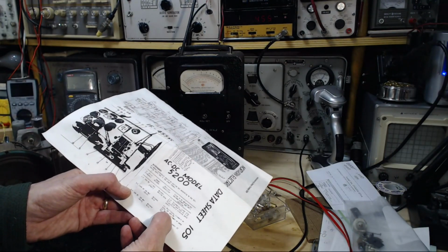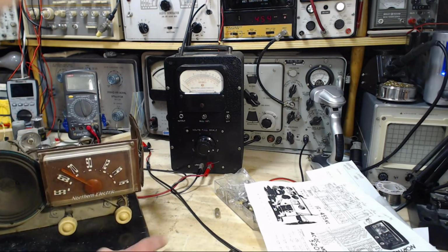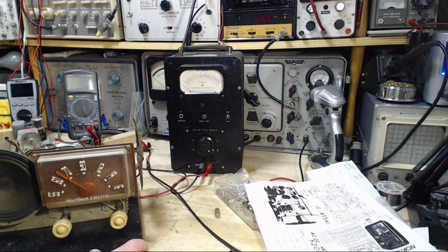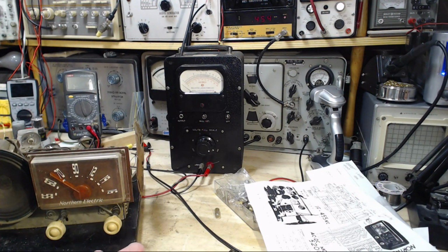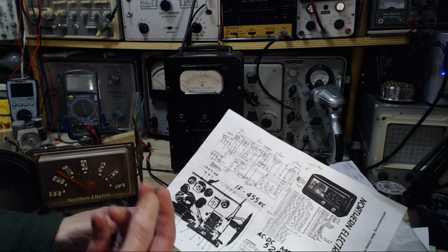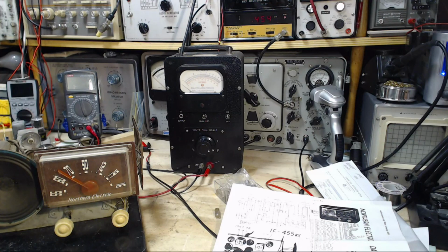1400. Oscillator trimmers on the gang, C4 and C5. On the gang. Well, that's not working out. There's two oscillator trimmers on the gang capacitor. One's going to be the antenna trimmer. The other one's an oscillator. So you know what? It has that piece underneath, and on this radio, the piece underneath for tuning is almost certainly the local oscillator. It does not appear in this photo. Let me look at this other. Well, let's take a look together.